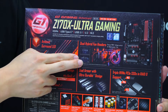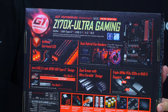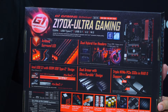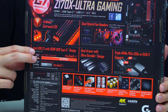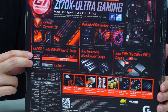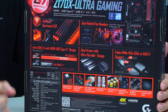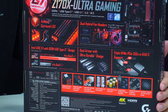The dual hybrid fan headers are a great feature for users trending towards water cooling, as they support both PWM and voltage calibration. So if users want to use water pumps or fans that rely on voltage to set the fan speed, the fan headers support both. We also have Intel USB 3.1 with 100 watt power delivery. The Intel chip on this board supports 32 gigabits per second of transfer, where the protocol only requires 10 gigabits — giving you a lot of bandwidth for transferring files from your desktop to a flash drive or portable device.